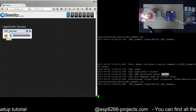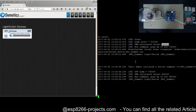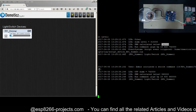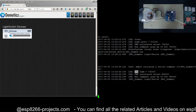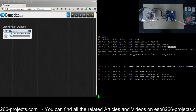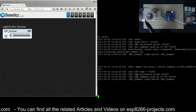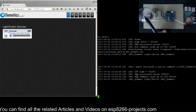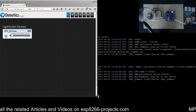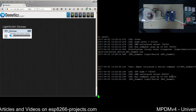Now let's turn the dimmer off. In the log we will see an off command received — it's an off event. Because it was an off event, it goes off and saves the dim value as it was before: 792. We decided the maximum PWM interval we want to use for this light bulb is 860, so the value used for the off command is 860. The corresponding command runs and that's it.